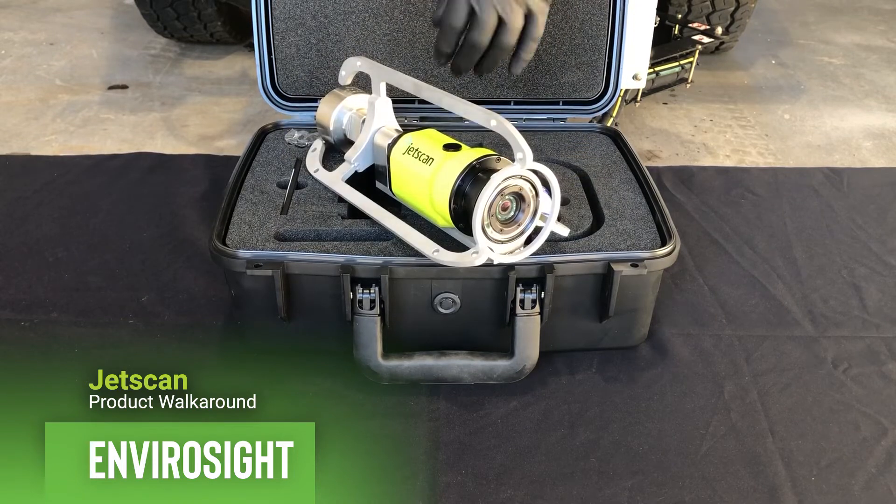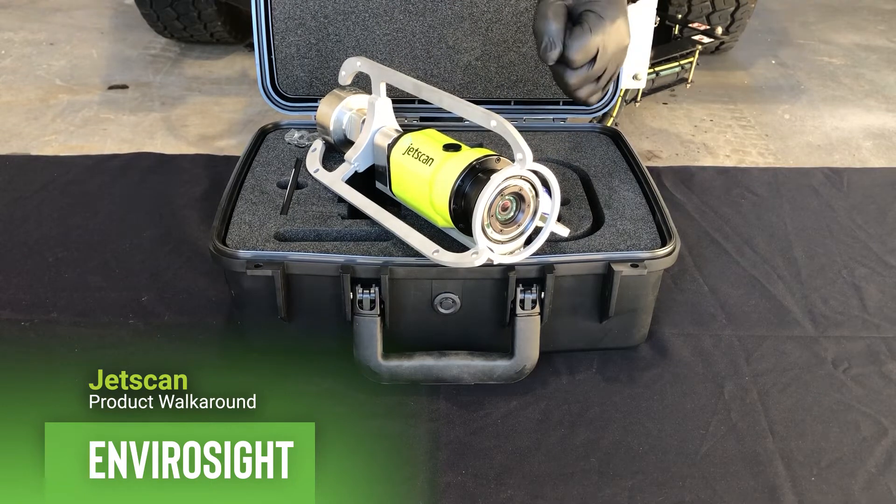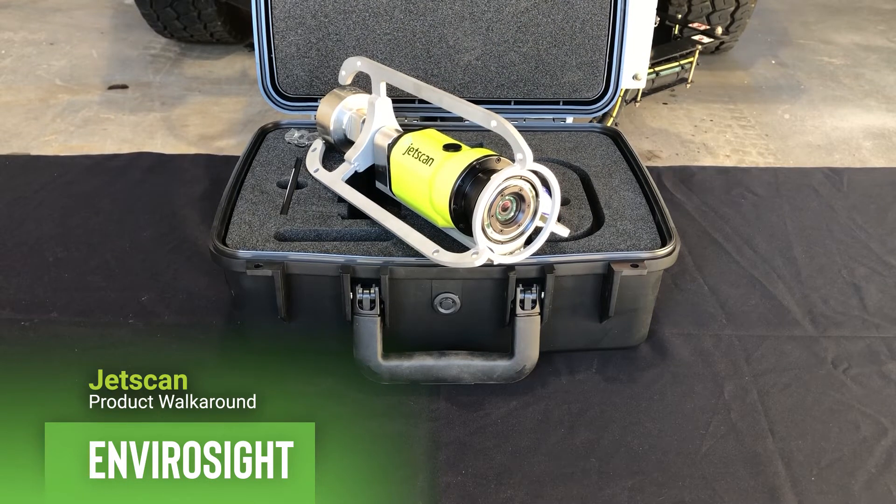In the process of moving the camera forward, we're recording HD video. It's not live video — it's right after live. After you get back to the manhole, it's going to stream all that to your tablet or viewing device. You'll be able to see exactly what your nozzle just covered, to know whether you need to spend more time at this particular location. You'll know if you have crossbores, root issues to address, or if the line is clean enough and ready for your mainline camera system to come in and complete the inspection.